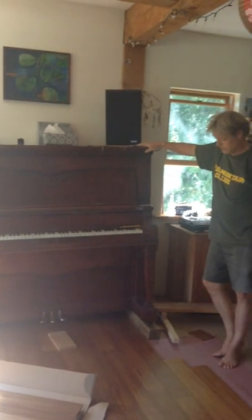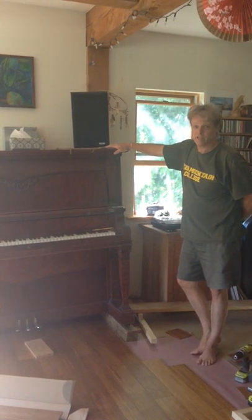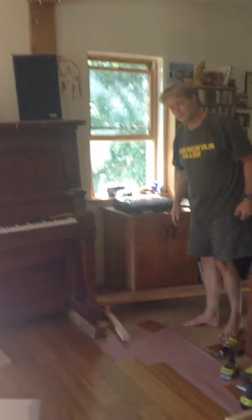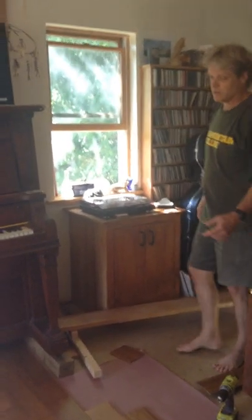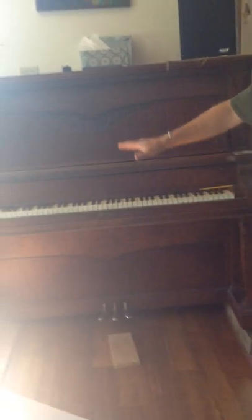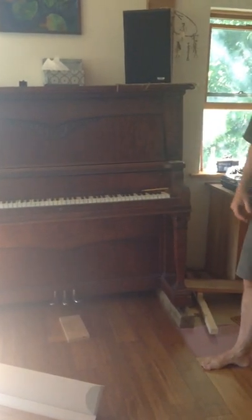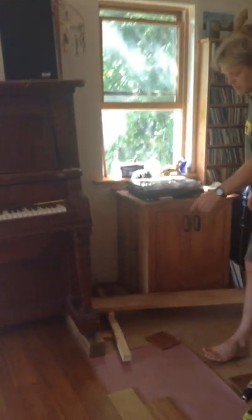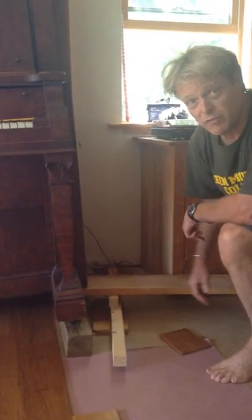I couldn't really move it very well, so I decided to raise it up one end at a time and lay the floor underneath it. I've been doing this with simple pieces of wood — 2x4s, levers and fulcrums. You can see I raised up the far end first, laid the floor underneath it, then laid that end back down on a board to protect the new floor from the wheels. Now this end has been jacked up, resting on a 4x4, but now I need to move the 4x4.